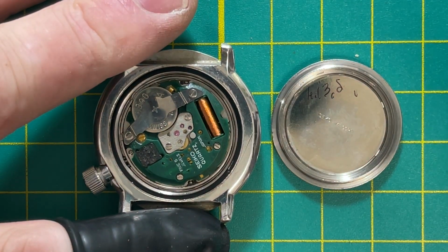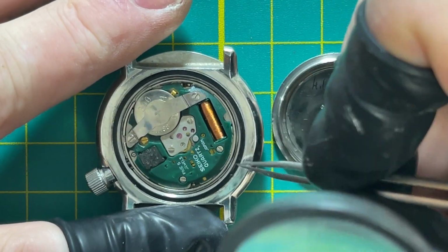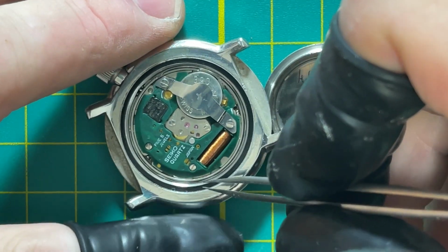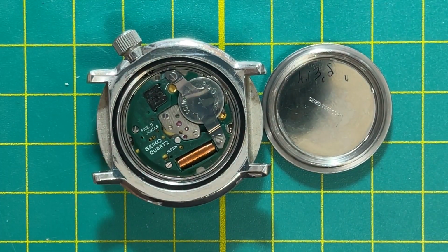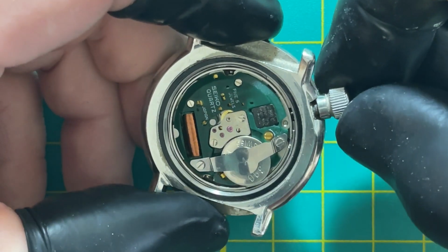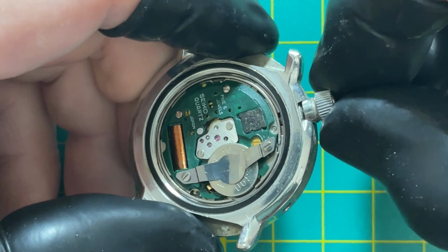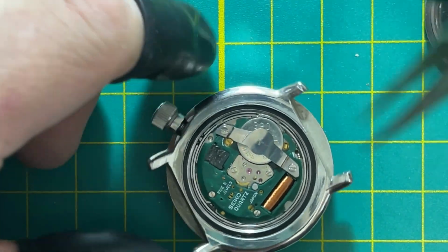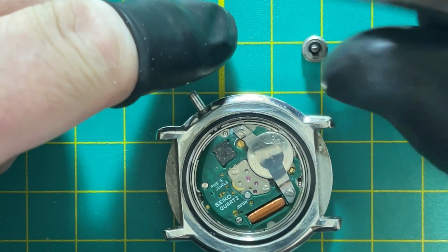It's original. It's a correct original plastic wrapped coil. That was a 7549 thing only. It looks clean. Your movement spring and your movement ring are nice and clean, I think. Those are the things that they rust first. Okay, so far so good. Your case back seal is completely flattened. Your threads look okay. Yeah, that's good. Well, I'll say this about your father. He knew how to properly look after the screw-down crown on his watch. To be commended.